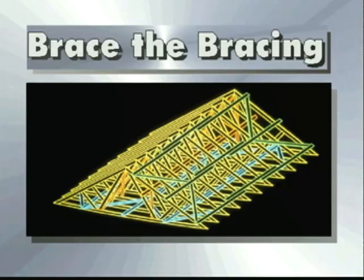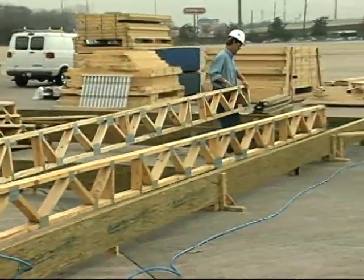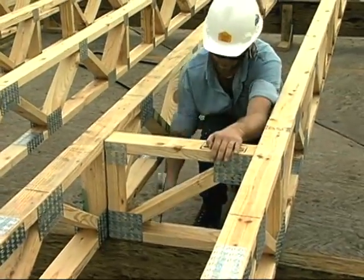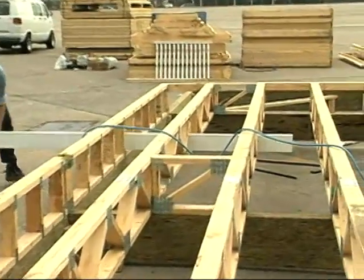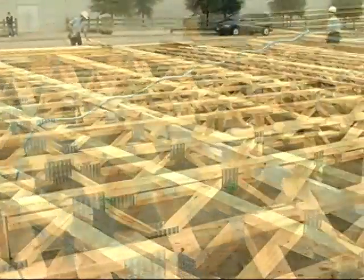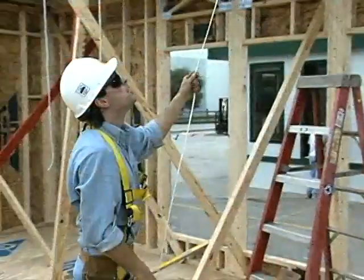This is also very important for floor truss construction. The same principles apply — long 2x4 lateral and diagonal bracing. Floor trusses are much easier to handle and work with than roof trusses. You will use blocking and band boards to transfer loads and provide a stable floor system. A strong back brace strengthens the floor and ties the floor system together as a single unit.